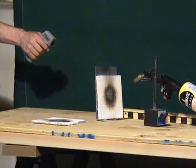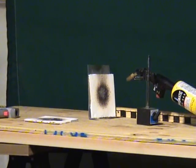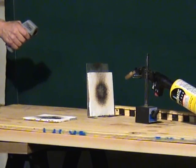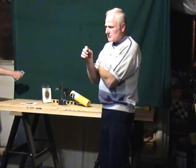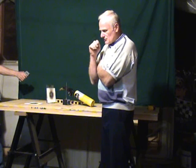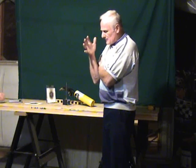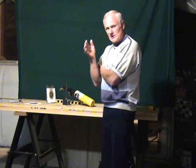Already you could see that the backside of the sample with the 2 flame out compound is dramatically reducing the temperature on the back side, which would be the inside of the house per se. The thermal conductivity of the material shows a drastic difference. So what's necessary in heating and cooling is how much energy is transferred through a very thin coating. And in a fire, if you transfer that coating through, and that heat, it is trapped inside of a barrier. It can be trapped outside of it, but that heat can also be trapped inside of the barrier.